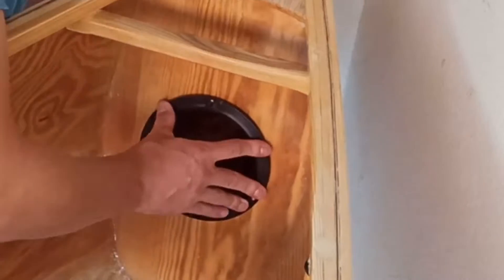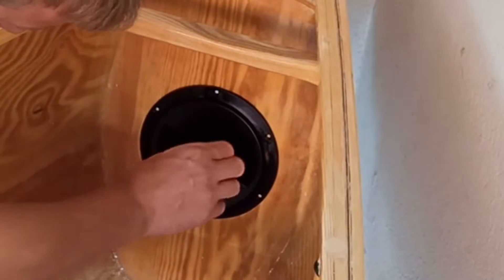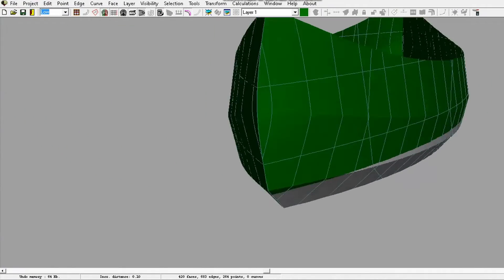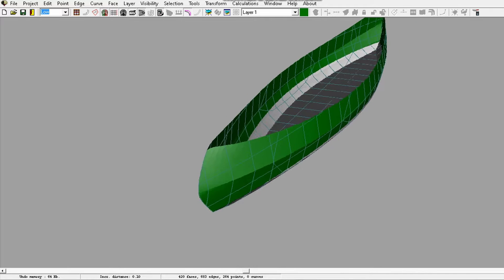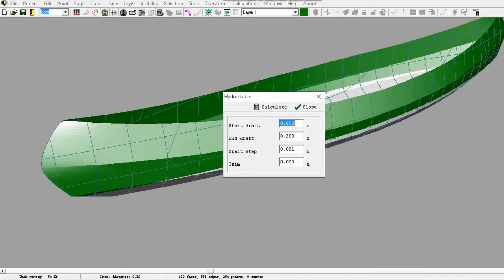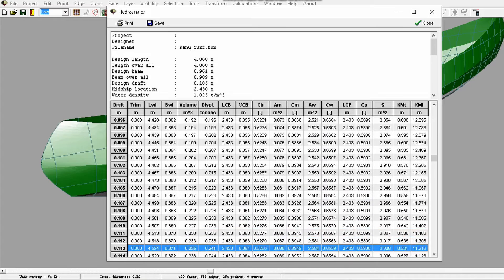For the outside of the hull I wanted a wooden look above and a resistant coating below the waterline. You can find out where the waterline is with your CAD system, but I used Freeship for it. Once a working model is available in Freeship it can iteratively be calculated how large the draft is at a given total weight — in this case 13.5 cm at 300 kg.